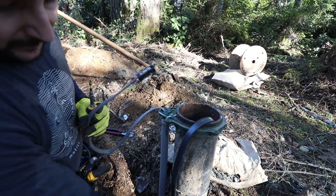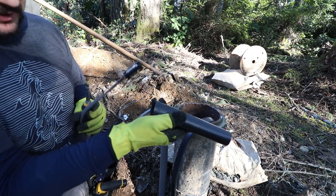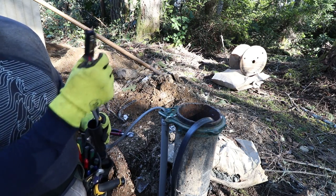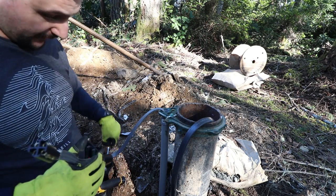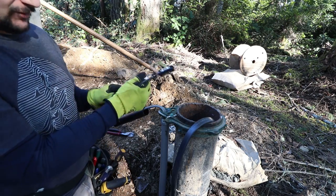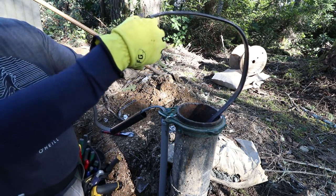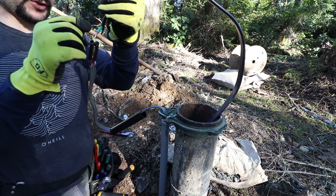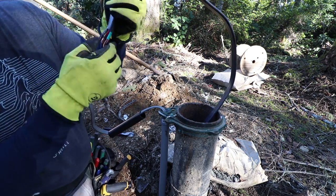Okay, it's very important you install the shrink tube before you connect the wires together. Otherwise you won't be able to connect the wires, or you won't be able to heat shrink it. So we'll get that thing kind of down over there. Now we need to get these three, but they have to correspond, so you need to make sure that you line them up appropriately.